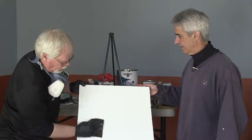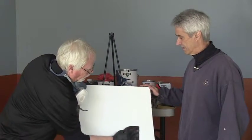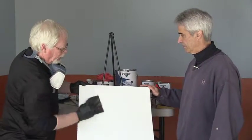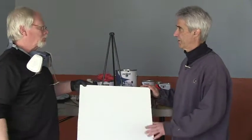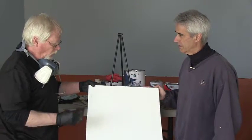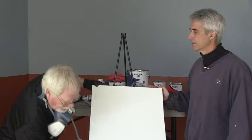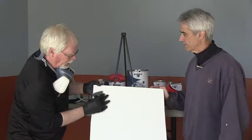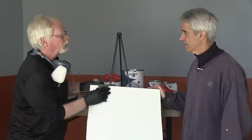You can use the solvent wash before you sand, and also after you sand. Or you can use the Bio Blue wash before you sand, and then after you sand to get rid of the surface. But this does a great job with those mold release agents and those other things that you're trying to get off. That's correct. The abrasive tool with the Scotch-Brite picks up that wax. After you've gotten that surface completely worked in, you liberally take water and a sponge and wash the Bio Blue off. And that's the whole technique.